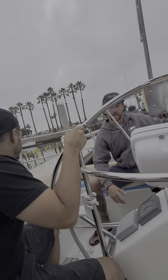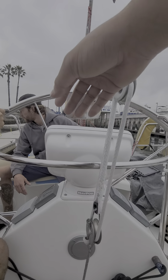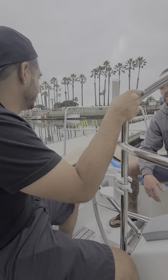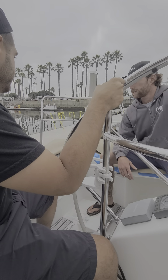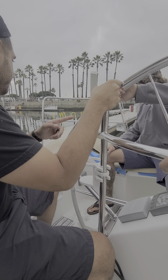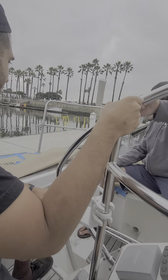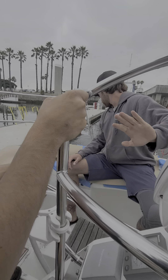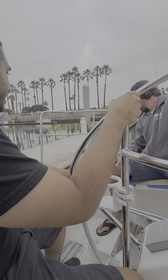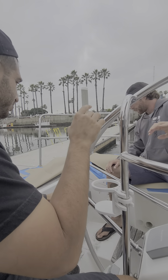The way to tell it is to put it in gear. You throw it one way — let the boat settle first, let the boat settle just straight on. Now turn the throttle, turn it. Can you see the thrust moving? Go the other way. Be nice to it, by the way — be careful. Big, big, big rudder. Big, fragile rudder. You see it now? It moves that way now? So you got proportional thrust in forward gear.